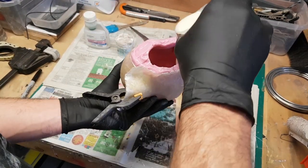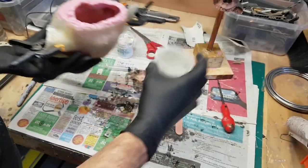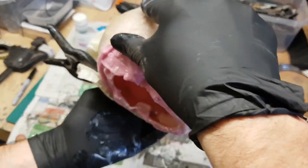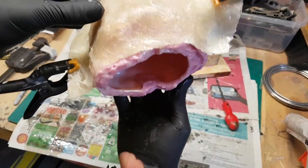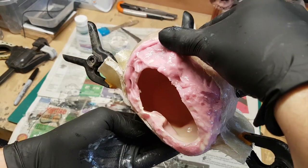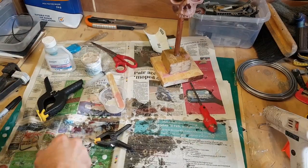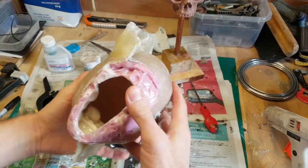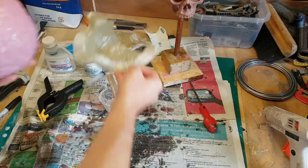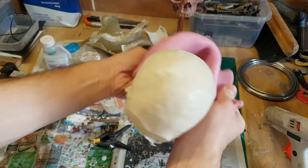There are polyurethane resins specifically made for rotocasting, but I've chosen polyester for a particular reason. One drawback is that it cures quite brittle — normally you'd laminate glass fiber into it for strength, but in this case I actually want it to be brittle. Another drawback is the cure time: the polyurethane resins go off in a few minutes, but this took about 15 minutes of rotating the mold. Polyester resin also shrinks as it cures, so the cast had come away from the edges of the mold slightly. Nevertheless it's cheap and readily available.